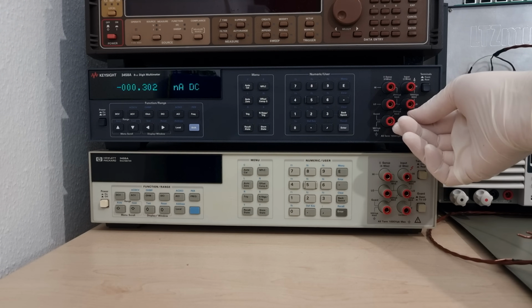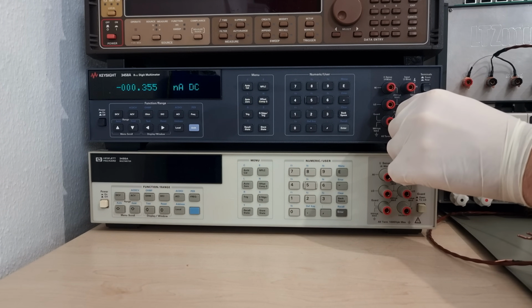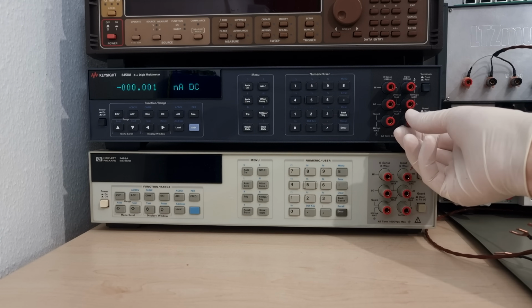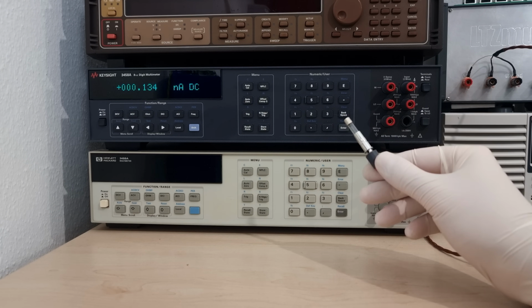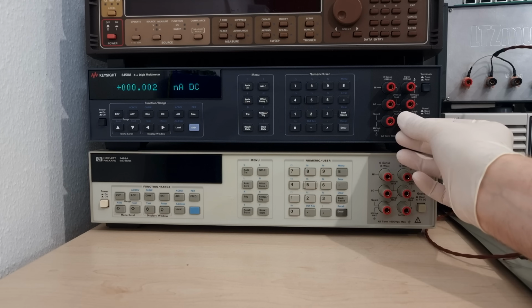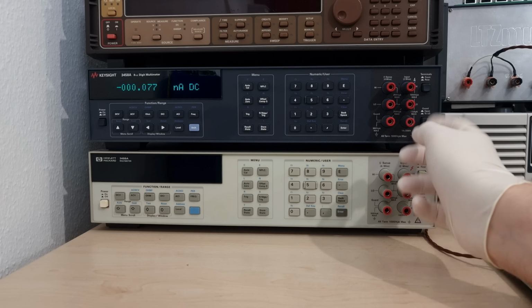We've got current capabilities too, but for once I don't have anything to say about them. It's cool that we can detect nanoampere directly. The fuse holder is hidden very well. You've got to kinda push in and twist out the bottom right binding post to eject an ordinary miniature glass fuse. No fancy sand-filled Bussmann as one would expect in fancy handheld multimeters, and that's okay because nobody would carry a 3458A to a murderous high-energy grid job. I hope.